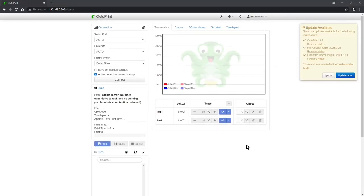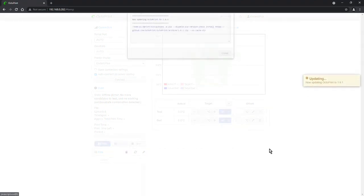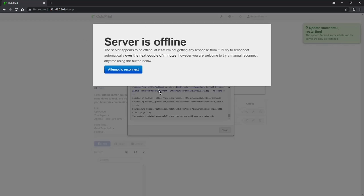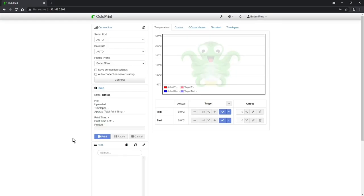Now that OctoPrint is set up, we're not ready to connect to the printer yet - there are a few more settings to adjust when we install Klipper. Go ahead and install the available OctoPrint updates now. Once they're installed, the Raspberry Pi will automatically reboot. We'll see the 'server is offline' warning - once it's back up, hit Reload. Now we'll pause OctoPrint configuration and come back after Klipper is set up and installed onto the printer.